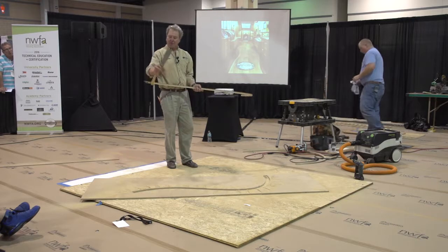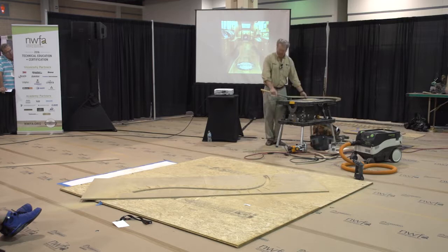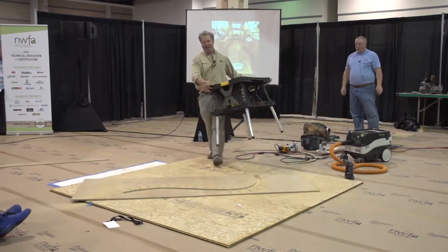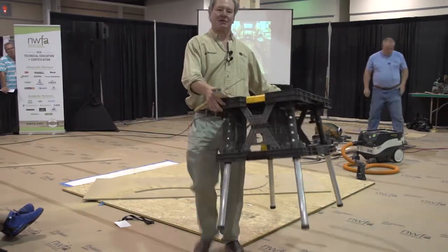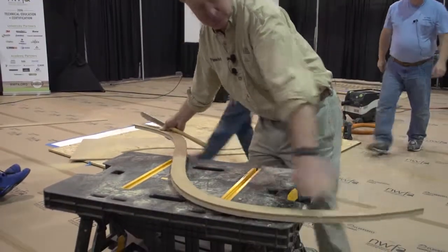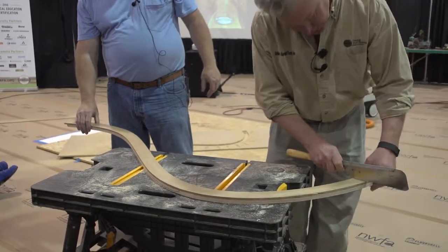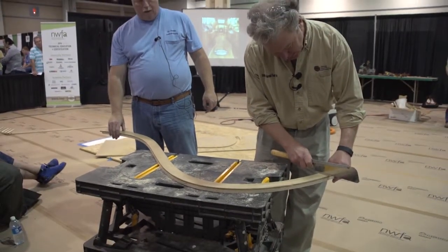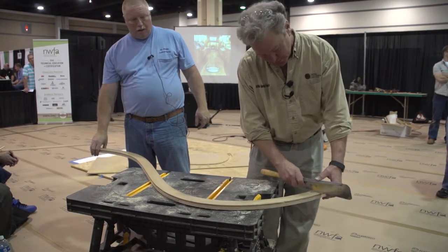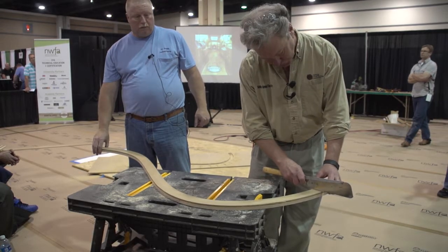This saw is pretty shiny, so it's reflective. I don't know if you'll be able to see this. Can I bring this over here? So this is the good piece. Say I wanted to cut it there. You put the saw in such a place that the reflection is a continuation of the line of the board.